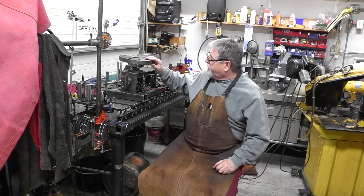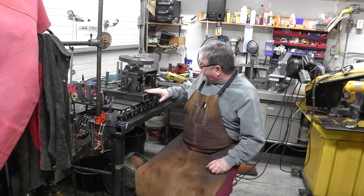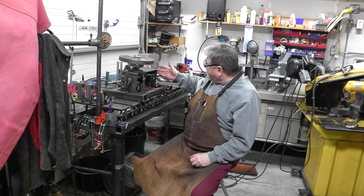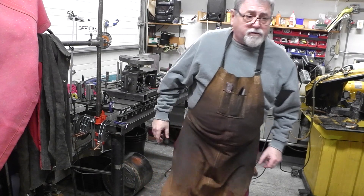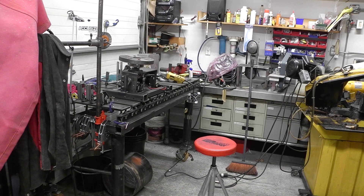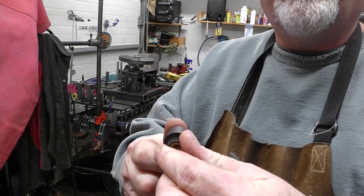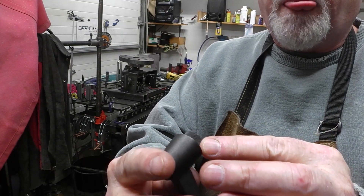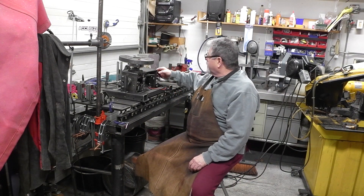That's it for the indexing table. I've got a few more screws to drill on the back side for the support — keeps everything nice, straight and rigid. I'm going to make a little bracket here that allows it to slide — I'll slot a piece of aluminum with a little handle. I acquired some functional handles — these little handles here lock it down and can be rotated any which way by pressing this button. I believe this one is 5/16 so that'll work out perfect.